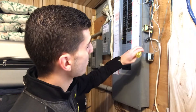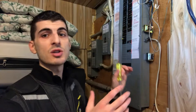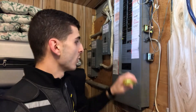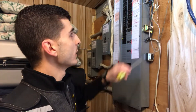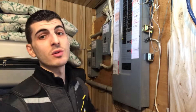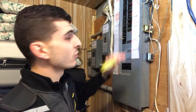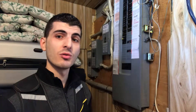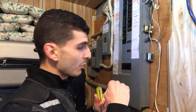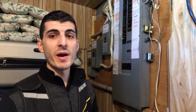Also, the entry points for the cables on the sides — or depending on the orientation of your distribution panel — have to be sealed properly. You'll see grommets that allow the cable to enter the distribution panel. Make sure all cables entering the panel have those grommets so the cable can't be pulled back, can't move.